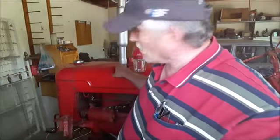Yes, it starts definitely easier, and I only, as you see, choked it with two turns. So I think it will make sense next time to put no choke on, because I saw some smoke again here after about 10 cranks, the smoke comes out there. I'm pretty sure the fire is good, so I'm gonna put it off and do another test later today, because the tractor is cold. So thank you for watching part 2, and I'm sure next time it will be number 1.